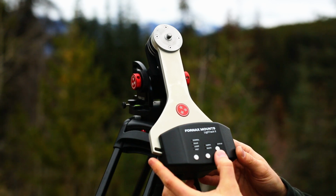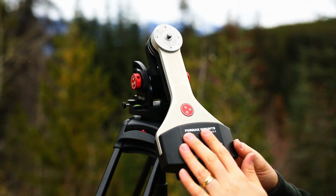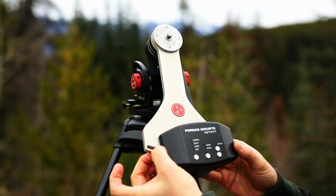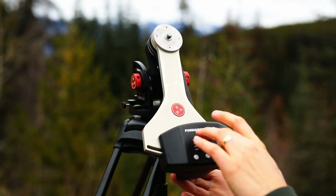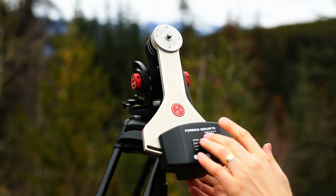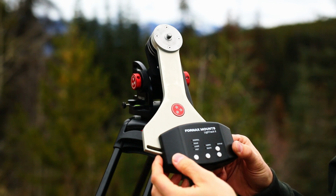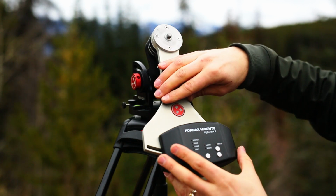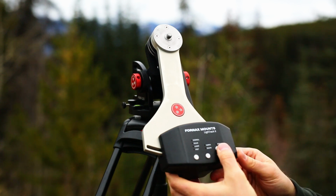Resetting is done easily using the quick slew buttons. The other thing that sets the LighTrack apart is that it has a friction drive as opposed to a traditional geared drive. You'll notice that the LighTrack has a smooth channel machined in the tracking arm. This channel is engaged by a very finely machined drive wheel or drive pin inside of the drive box, and that connection allows for a very low periodic error. When tracking with the LighTrack, there's no backlash to worry about, no sloppy gears, and no grease. It's just metal on metal, and it moves in a very precise manner. When engaged, the tracking arm is held very solidly by the drive, and this is what helps the mount track such heavy payloads.